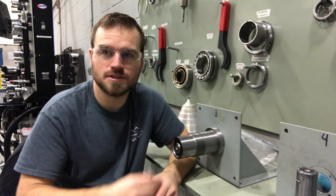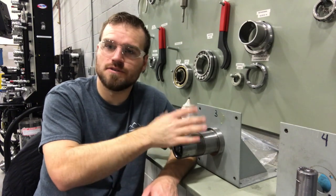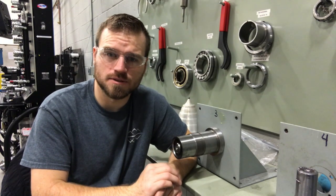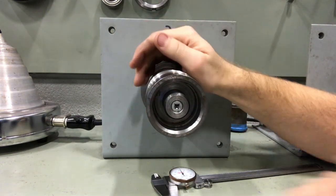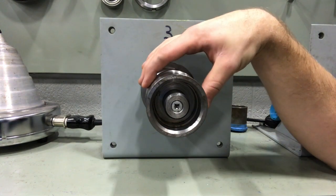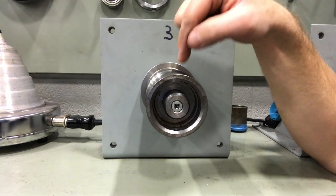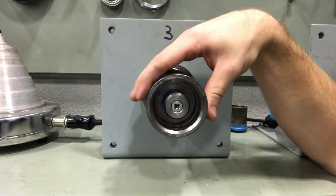The last thing I want to talk about is shaft roundness. Typically a shaft is going to be round, but if you did want to inspect it — maybe something looks up with it, it's possibly bent — you want to look it over for roundness. The way we're going to do that is with a set of calipers. We're looking at the shaft head-on because we're looking for roundness, looking for this surface to be round all the way down the shaft. We're going to take multiple measurements all the way down the shaft in multiple planes, and then compare those measurements to each other. A measurement from here and a measurement from over here should be identical — if they're not, there's probably something wrong with the roundness of that shaft.